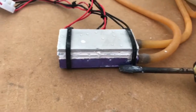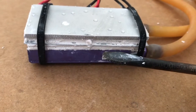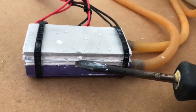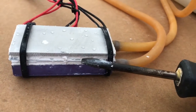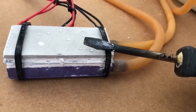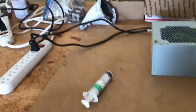So first of all, here's your block. On the bottom are two of the thermoelectric modules side by side — those ones are operated at 12 volts from the computer power supply. Then there's some aluminum sheet that has been cut to the right size. Then two more thermoelectric modules; these ones are being operated at 5 volts, and that makes the unit more efficient for getting better cooling. And then on the top you've got some aluminum strip that has been cut down to size. I have the unit running right now and water's flowing.